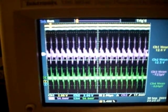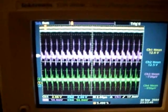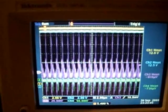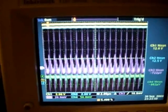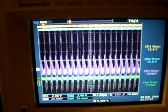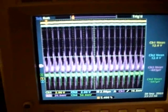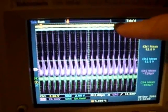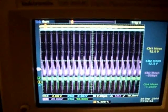With enough whole waveforms in there, you're going to get negative DC averages on both. I can increase these both. Even though it looks like it's in the line, that purple is kind of coming off the scope on both ends. Usually if the waveform is going off the top or the bottom it's going to say positive clipping or negative clipping, but I don't really like to leave it outside the line even if it doesn't say that.